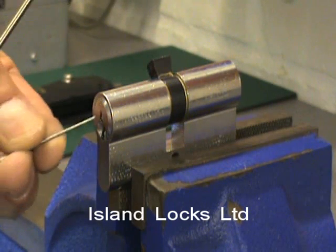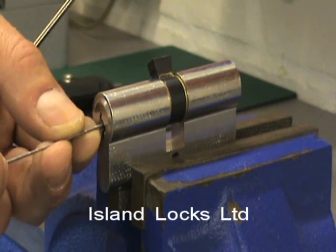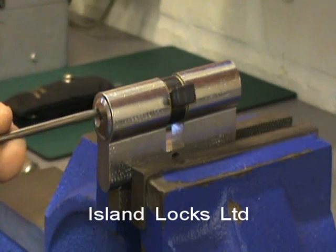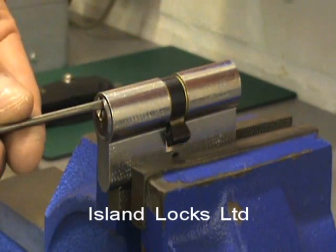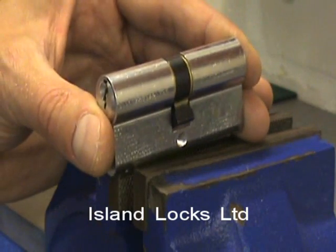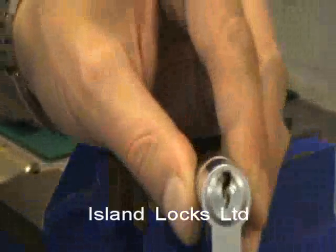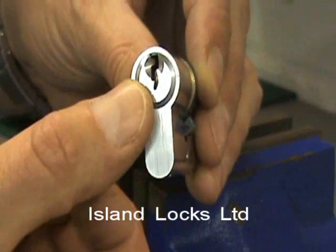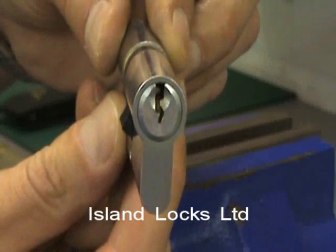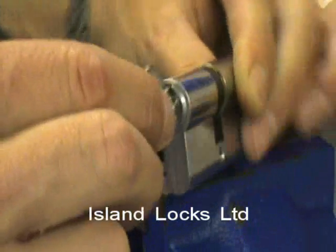All I do is insert my steel just in the centre of the keyway, feel for that bar, and push it in. Now when I turn the plug, it turns the cam. So I can bring the keyway back to its true position — the cam resets, locked off. Now I have the lock in its correct position: keyway locked, cam in the right position from both sides. So now we have a lock that works the way it should.